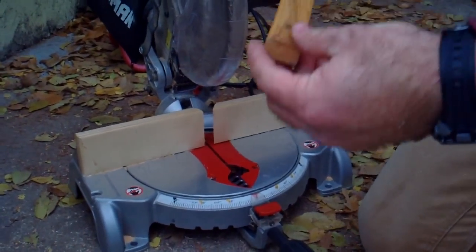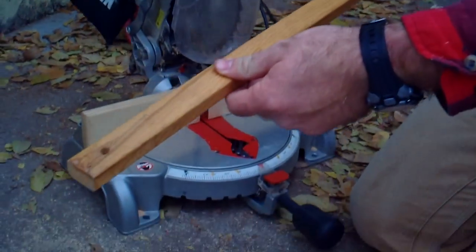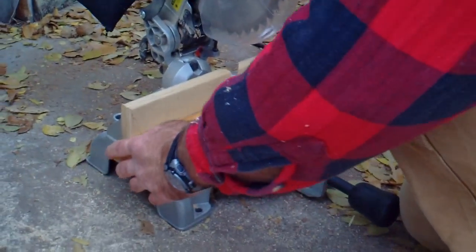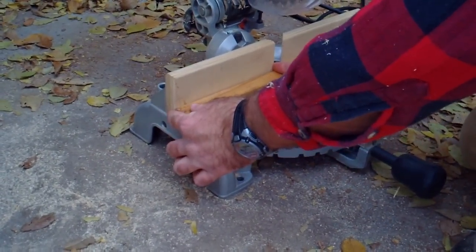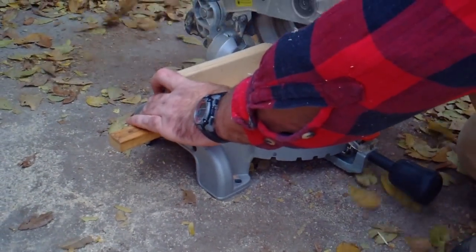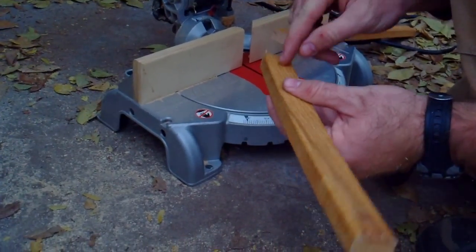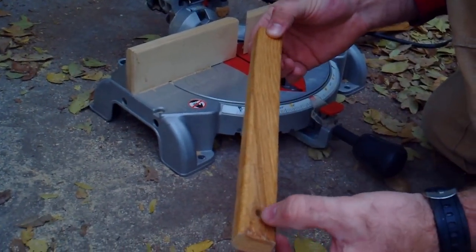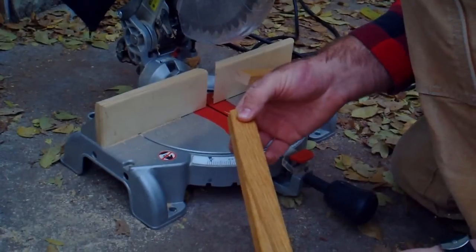We didn't have a compass, so I'm going to take this piece of oak and recycle it into a compass for drawing circles on my bowl blanks. The length doesn't have to be precise — even a five-inch piece will do a ten-inch circle, so I'll make it a little bigger. I'll drill a hole and put a nail through there, then put a couple of different holes spaced evenly from the end, and we'll have ourselves a compass to stick pencils in and make our circles.